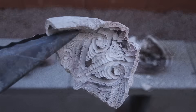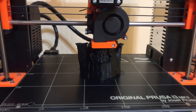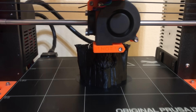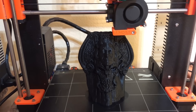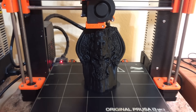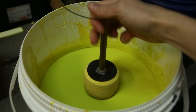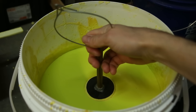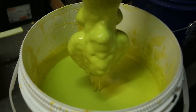After thinking about my next approach, I decided to toss the idea of trying to make the casting hollow, but this meant making the casting slightly smaller and attaching a very large sprue. A large sprue is necessary because it helps supply the casting with metal as it solidifies and shrinks. I also used a different PLA filament, which I know from experience burns out without leaving any ash behind, and I also made the ceramic shell much thicker this time around.